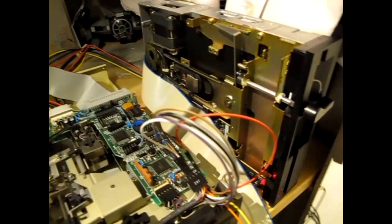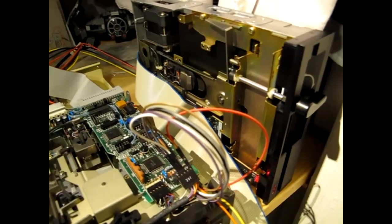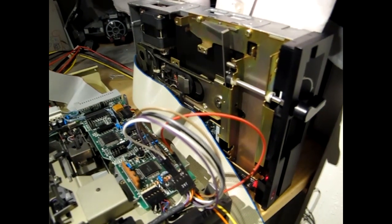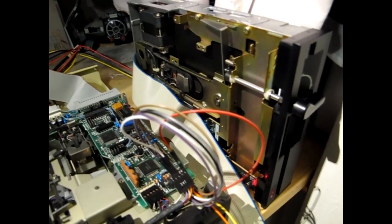Every time you see the high density peaks popping in, that's the signal going to the disk drive's write head. It's going click, click, click, once per track. This is a 40 track disc it's writing. So in theory, you could count 40 clicks before we're done.